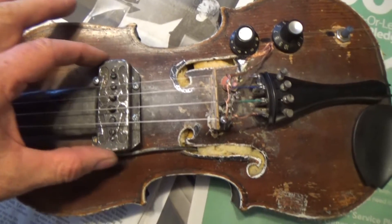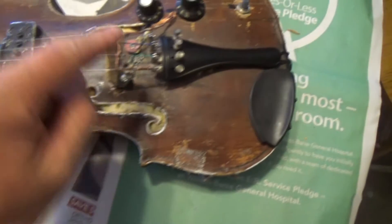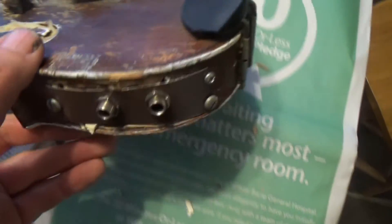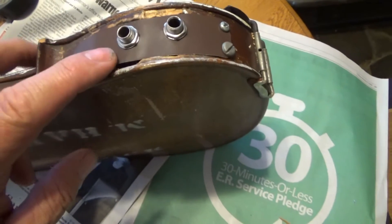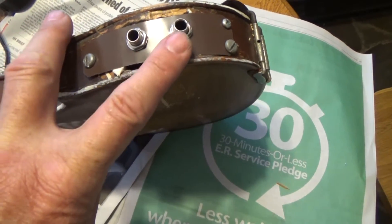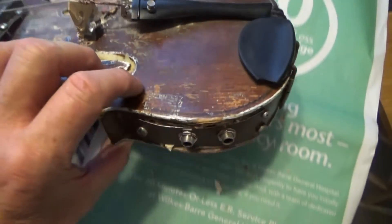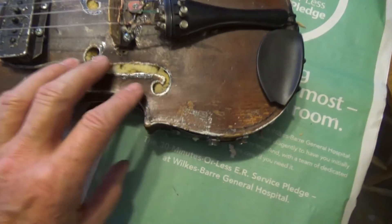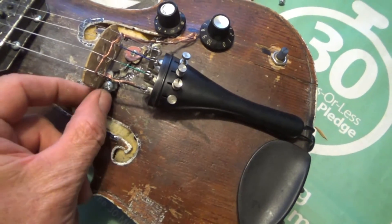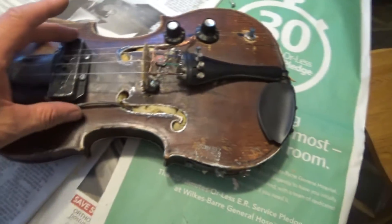You notice how the hum stopped when I shielded everything. So I put my guitar pickup in, went over into my volume control, and it came over here into my output. Now this is the output for my Fishman transducer, and this is the output for my electric guitar. I didn't want to combine them together. The Fishman — I put a piece of rubber in and jammed it in there. So now I've got two different pickups.